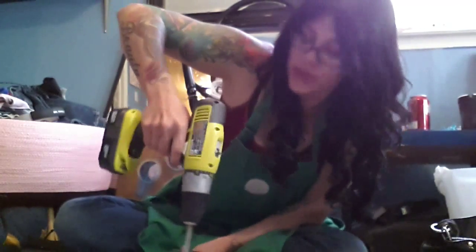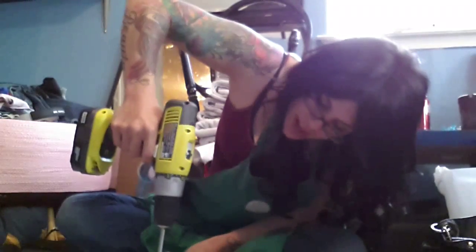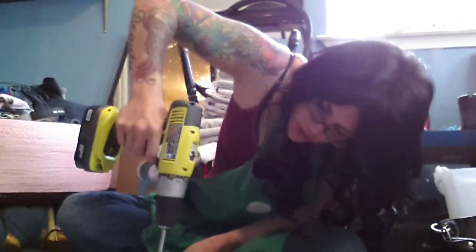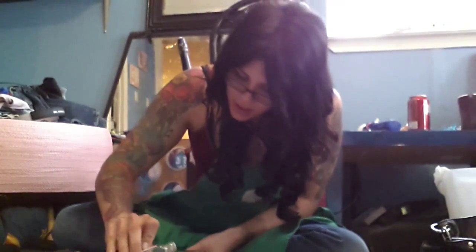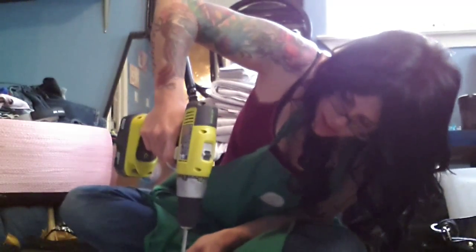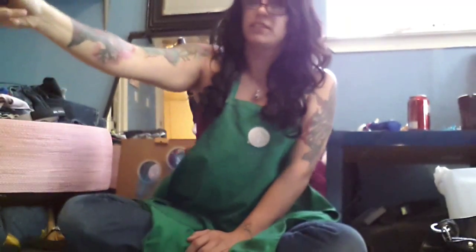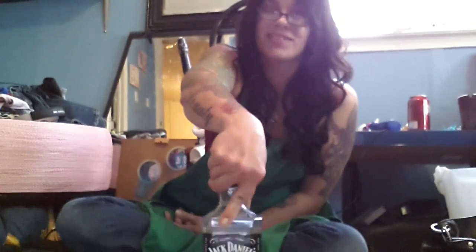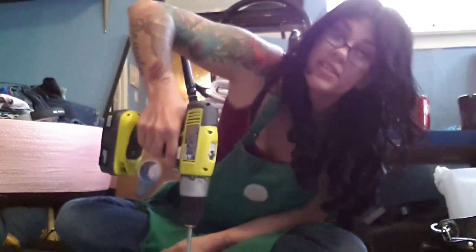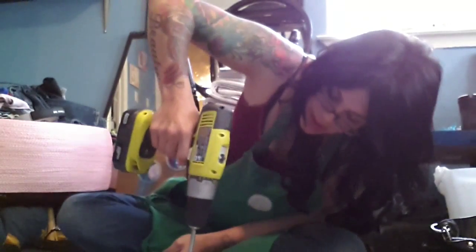Let's see if we can go ahead and get this hole to break through. I have a big water bucket over here — originally I was going to try the theory of submerging the bottle, but I kind of messed up and put way too much water in there. So I am doing this by using cutting oil, and a lot of it, just because I've been doing this for a while today and I don't want to break the bottle.